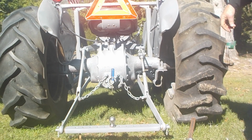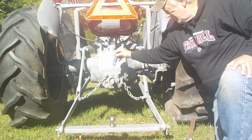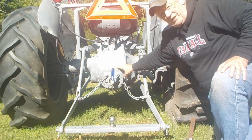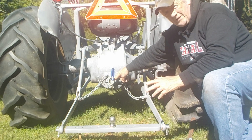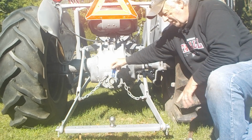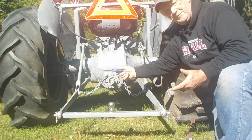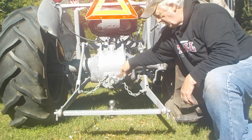Now, using the screwdriver, screwdriver into the hole. What you are doing here is basically manually operating your hydraulic pump inside the tractor. You're operating the hydraulic pump just like it was a floor jack or a bottle jack, the same exact way. I'm going to move this back and forth. You keep your eye on the drawbar, which represents the implement. Adjustable wrench, same way, back and forth.